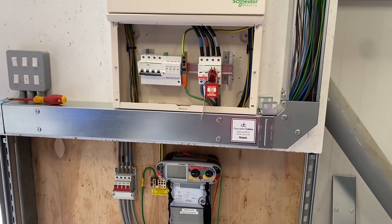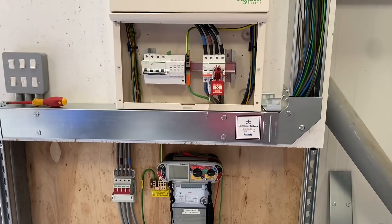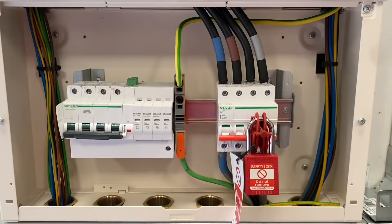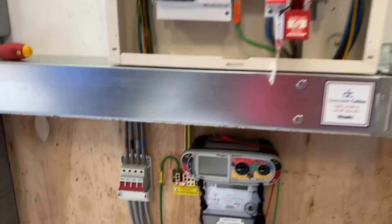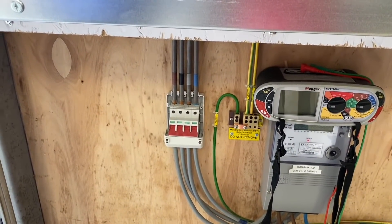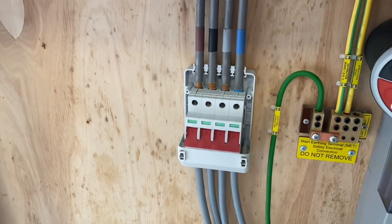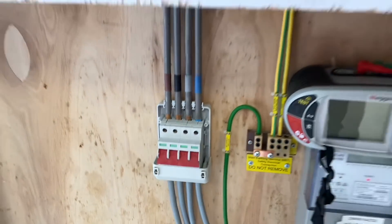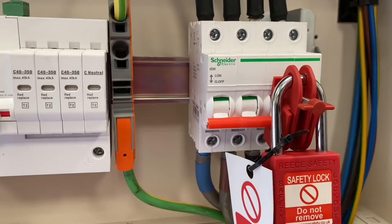If this is going to help with AM2, we're going to have to look at the arrangement we've got here. We're going to carry out that external fault loop impedance test, but we've actually got the main switch here — a four-pole switch for our three-phase distribution board — but in our system we've also got an external isolating switch where we're going to carry out our test. If for some reason you don't have one of these at your AM2, AM2S, or AM2E assessment, everything we do here would actually be carried out at the bottom of this switch, which you can see is in the off position.